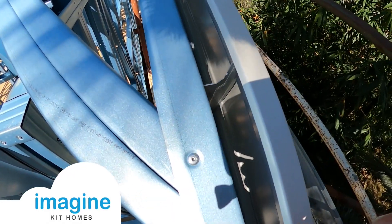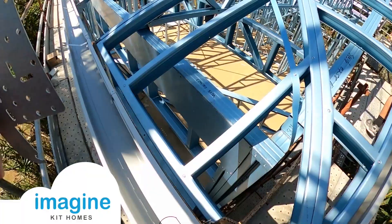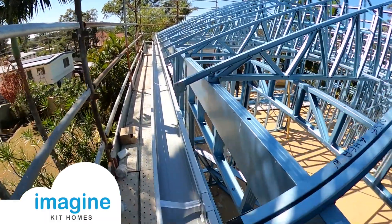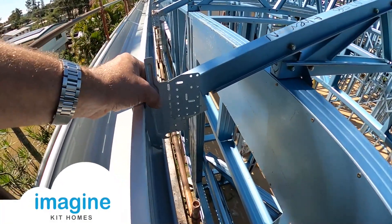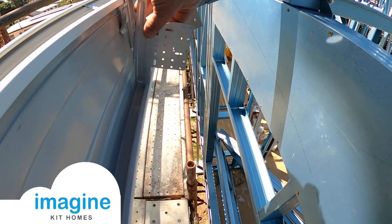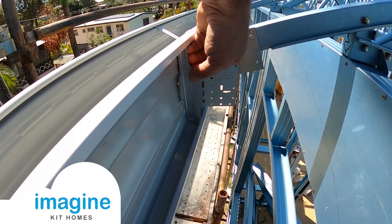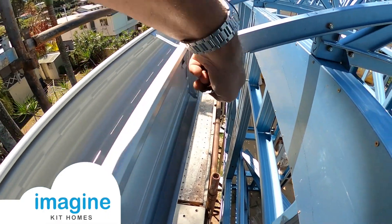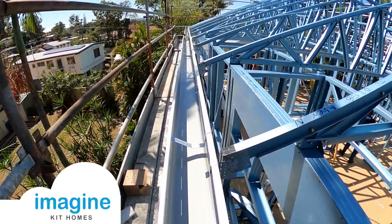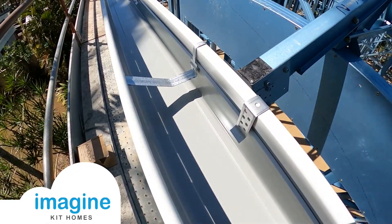On this one here we've bent the bracket by 90 degrees so it just gets fixed onto there. So these are the fascia brackets — these get stuck on, you can just see on the end here like that. You can see how that all clips into the actual fascia there until it slides in like that. It's a simple system, just a matter of running all your fascia brackets on there with the string line, making sure it's all straight, and then just sliding the fascia on and then the gutters just clip on and these hold them in.